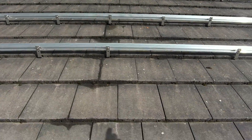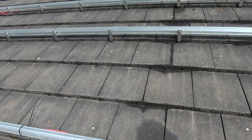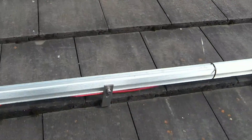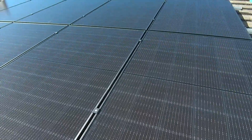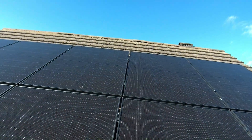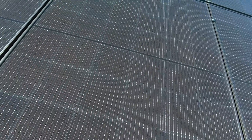Up on the roof, the brackets and rail are all fitted. The brackets simply screw down into the rafters beneath - you push the two tiles above the one you want to lift up and out the way, lift that tile and grind off the back, allowing it to fit over the hook without damaging the tile. You want a bit of a gap between top and bottom so they're not going to get damaged later. They fasten to the rail using an Allen bolt, securing everything together in a nice rigid system ready to mount the panels. Cables are loosely fastened but do get fixed all the way along using metal cable ties. Panels are all mounted with end rail fixings that clamp down on top of the panels - four on each panel. This is an open field behind this roof which gave us concern about wind loading, so we may have gone a bit over the top on fixings, but better safe than sorry especially first time out. The customer's very happy and let's see how this lot tests out.